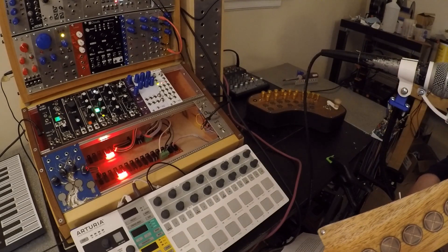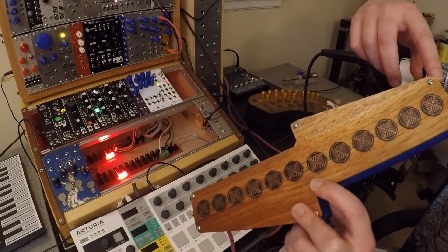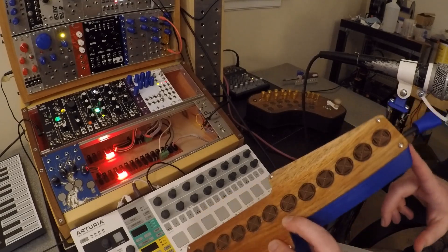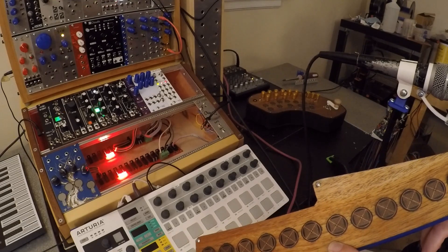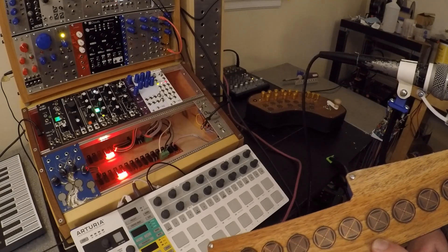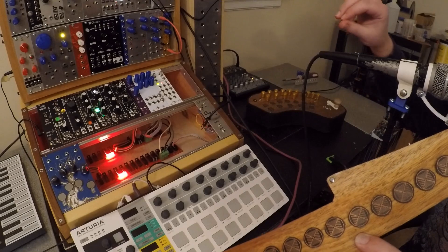The way this instrument works is pretty simple. You just blow into the mouthpiece, push one or more of these 12 touch plates, and you get sound out. The pressure sensor is controlling the cutoff of a low-pass filter and I've found it to be very expressive. It's really easy to make legato lines or staccato — all I'm doing is changing how hard I blow and doing kind of a "ta ta ta" to generate the fast attack.